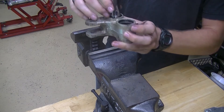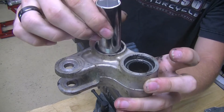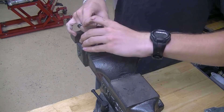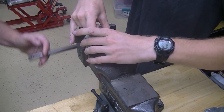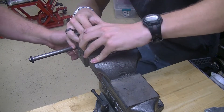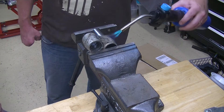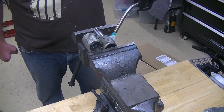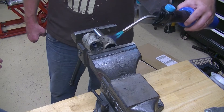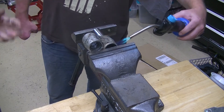Set it right on the edge of the bearing and make sure that you aren't pressing on the metal outer section — you want to make sure you're pressing on the bearing itself. Then tighten up here, and make sure to keep an eye on where the bearing is. When you're heating up, there are a couple different techniques. If you drop water on it and it sizzles, you're at the right temperature. Or you can use a little IR thermometer and get it to about 230 or 240 degrees Fahrenheit. You want to work all the way around the bearing and not just focus on one place in particular.